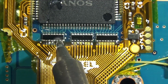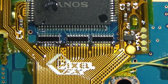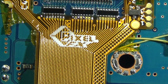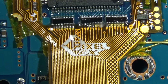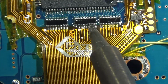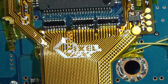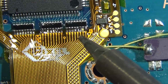And with this, I'm trying to explain my strategy, but what I like to do with these flex cables is where those teeth are. So where the teeth either grip the legs or grip the resistor packages, you're looking at those teeth, and you're going to want a nice joint there. You don't want to really see the outline of those teeth. So you have that visual cue, is what I'm going for, that it's connected. You've got a nice meaty joint there.